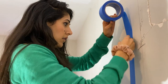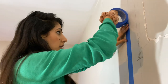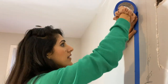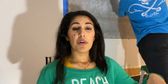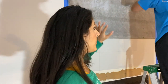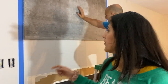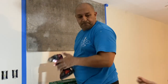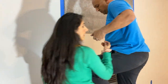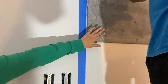We're just putting some blue painter's tape on here so we know exactly where the backer board should start and end. When you are putting stone onto a fireplace like this, you do not want to put it right onto the drywall — that will not hold. You want to use a porous background like cement board or backer board, so that is what we're using.